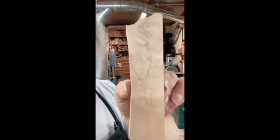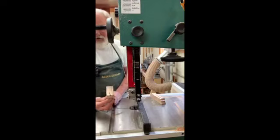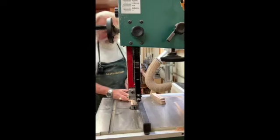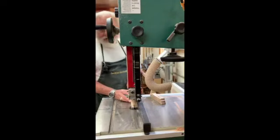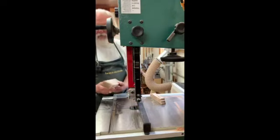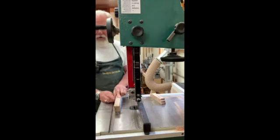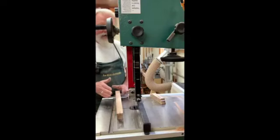We're going to take some steps now to make it one headpiece. I've used a scrap piece of the same material to locate dead center with my bandsaw. You can measure all you want to, but an easy way to get perfect center is to slice in a short distance with your bandsaw, flip the piece 180 degrees and slice in again. If you're off center, it'll show immediately, and then you can make adjustments. To get these two pieces perfectly even is not critical, but again, the closer we can come in the long run, the better off we're going to be.